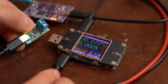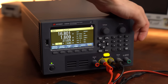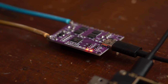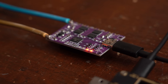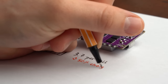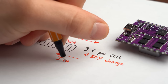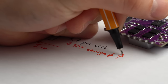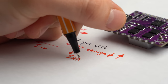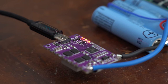With that done I was able to activate all the different voltage levels. I then lowered the input voltage to see how the battery level monitor LEDs would react, but they apparently didn't care at all. It turns out the IC uses a fuel gauge monitor — it determines the initial battery charge through the startup voltage, then measures power going in and out to update the battery level LEDs, all in accordance with the set capacity of the battery pack. I tested this later and the feature works just fine.